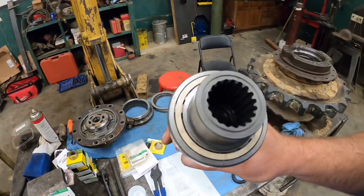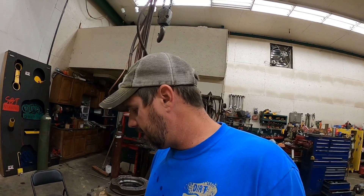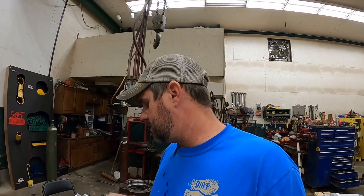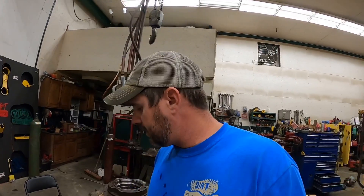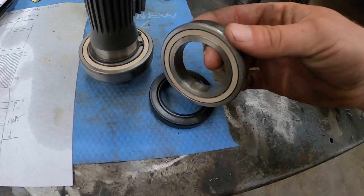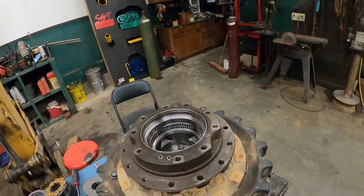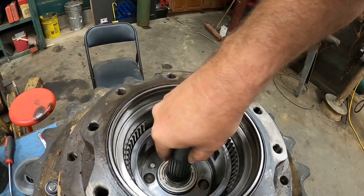The next thing is we got the new shaft, which is finally the right one. The guy from Smith Tractor Parts down in Florida - John - he was actually pretty good to work with, he helped us out quite a bit. This bearing is a little bit goofy - it's got a two-part race in it, and the thrust washer part does need to go a certain way, which I believe is down. It holds on the shaft with two snap rings, so it's actually the first thing to go down in there. We'll push it down through the seal with a little bit of lubricant on it and just work it in there.